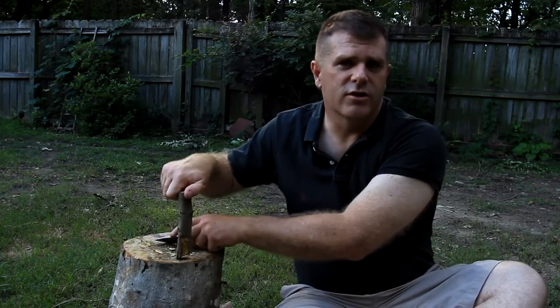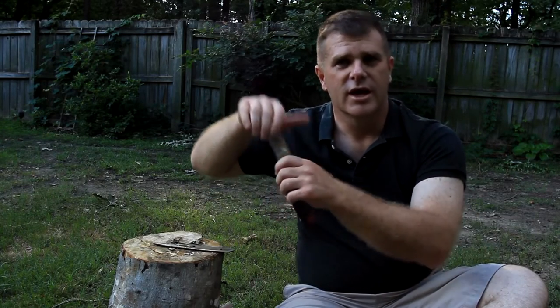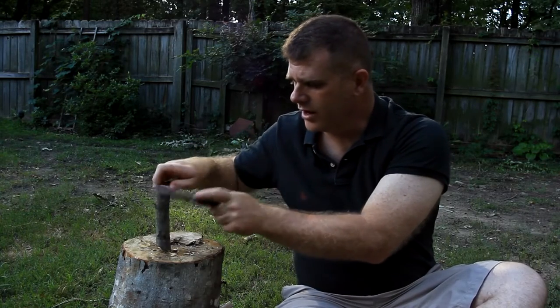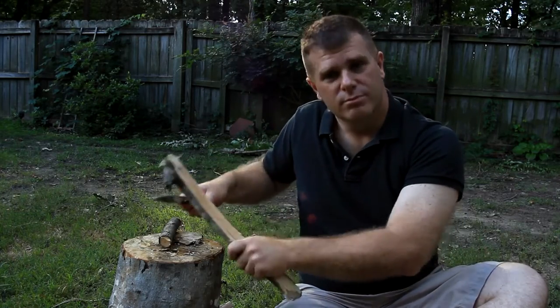I will finally get to a point where it can very easily snap off. Sometimes they call that a rosette because it kind of looks like the petals of a flower at the base where I've made those cuts. It allows me to take a larger piece of wood and break it off into a more manageable, project-size piece. I could do a beaver chew — a 45-degree cut down through — or I could take my knife, bring it into the piece of wood, and with my baton make a clean cut. Either way, I'm taking a larger piece of material and bringing it down to a smaller, more manageable size.